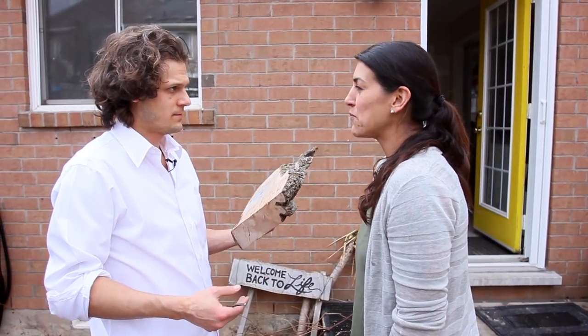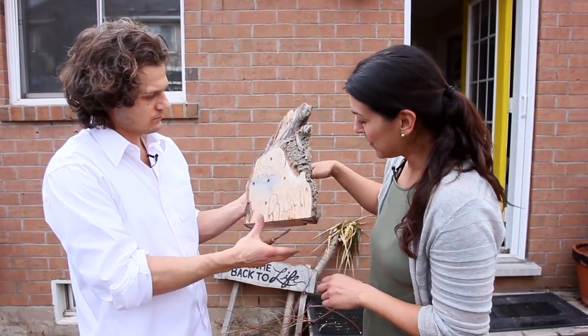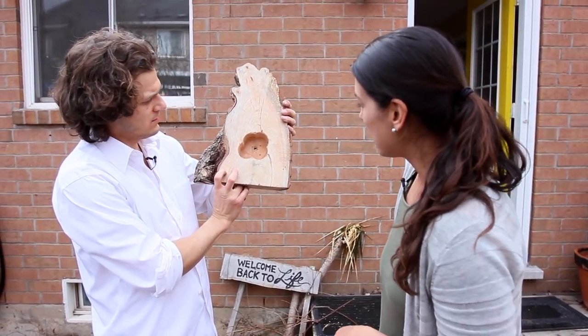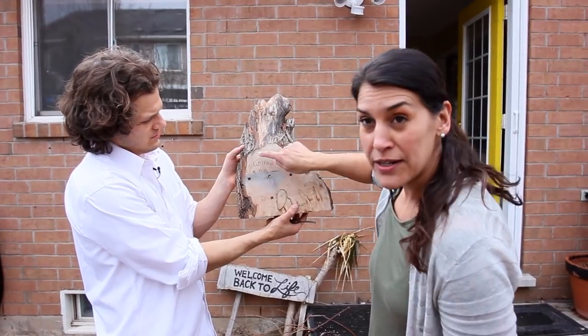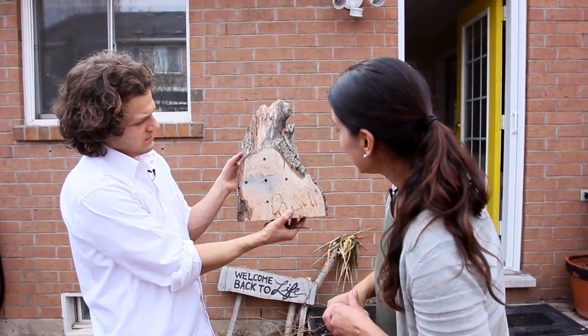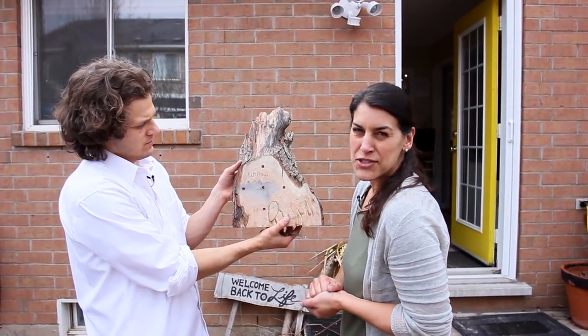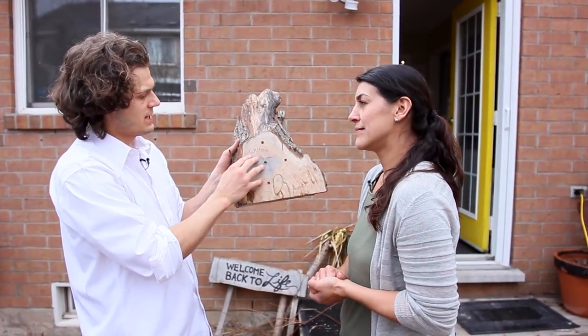Well, Dave, I think it's break time. So look at what we've done today. We drilled a big hole in the back, or four holes to make a big hole in the back for our clock mechanism. And then we drilled our 15 minute increments here. And the next step is going to be a pre-seal, giving a real thin coat of art resin just to prevent any bubbles. And we'll sand it first to take this off.